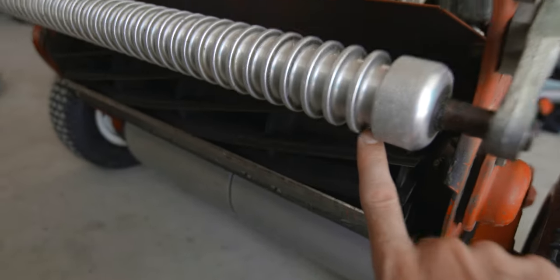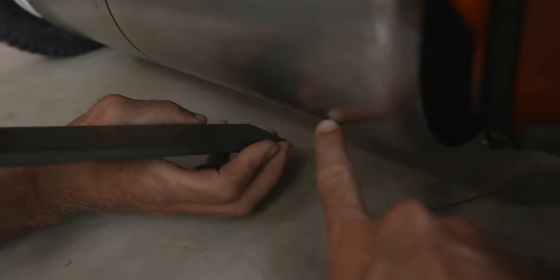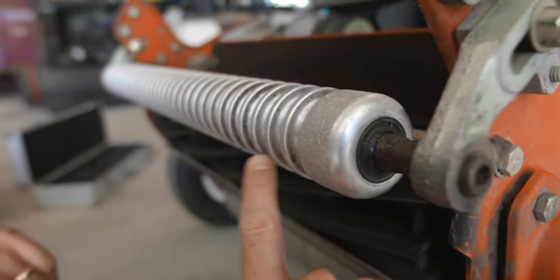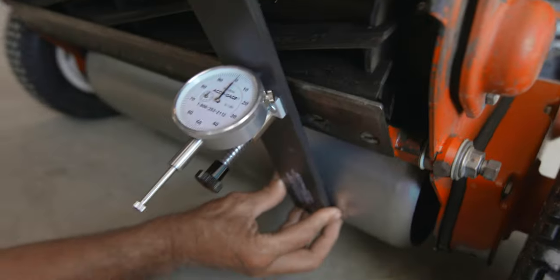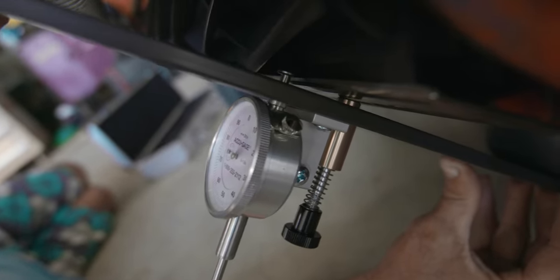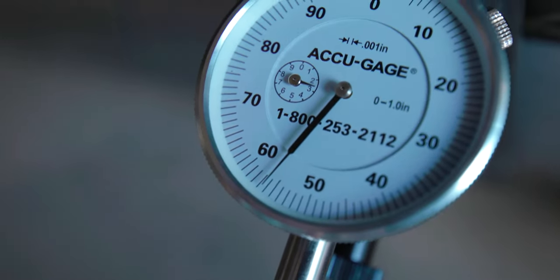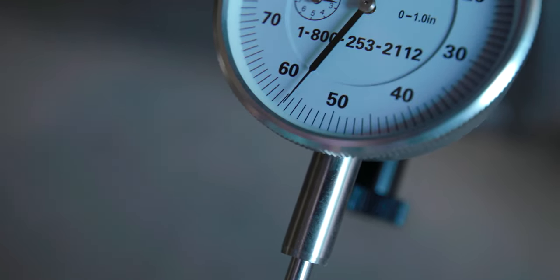What the AccuGauge does — go ahead and place it on this side. First we put the back end of the gauge up against the rear drum, and then the front portion touches the grooming bar. Get it nice and perpendicular and square. This cool little piece here — you push it up and it engages a magnet. There's a little plunger you push up, then lower it and snug it against the bed knife so it rests on it. It should be hands-free once the magnet's engaged. Let go of it and then we can get a readout. What are we seeing? I've got to get my glasses. What I'm seeing is 256.